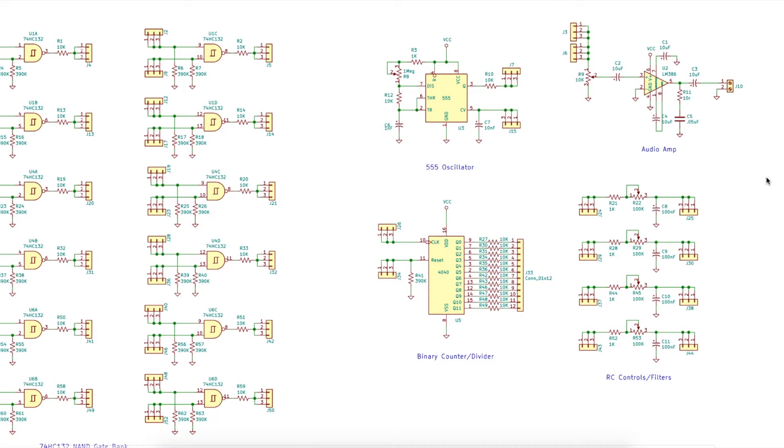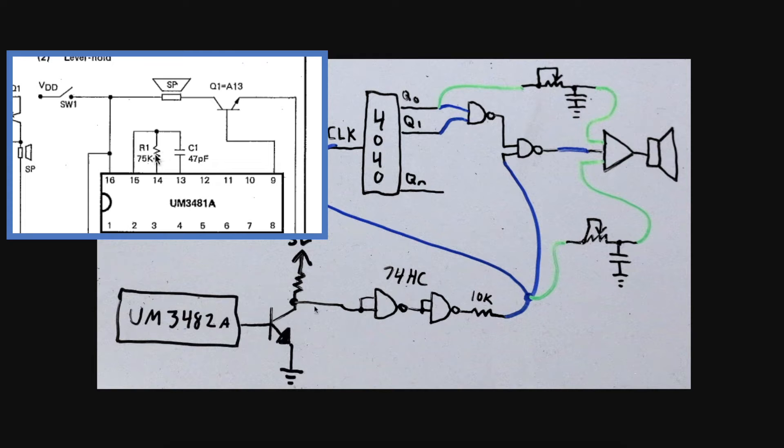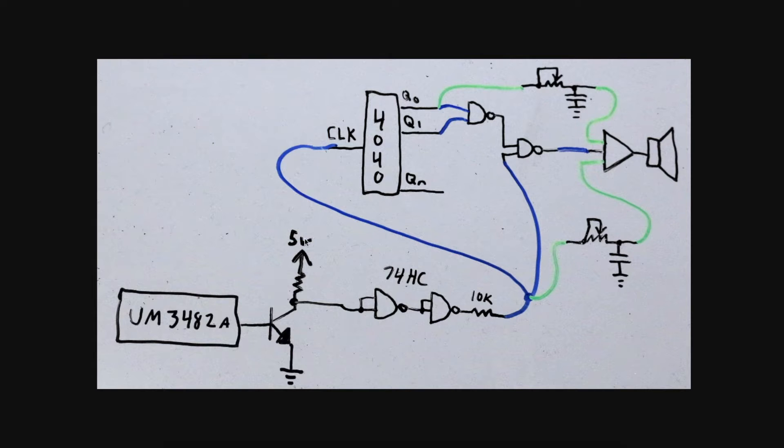Now I wonder if I can maybe improve the sound just a little. I'm going to use this sound logic board that I made last week. This is a block diagram-ish schematic of what I intend to do with this melody generator chip. This being a three-volt circuit, it needs to be five-volt compatible for this board. So I'm using that transistor that used to drive a speaker and turning it into an open collector that I'm pulling up to five volts from this board, so the highs and lows will be a pull-up to five and a short to ground when the transistor's on.